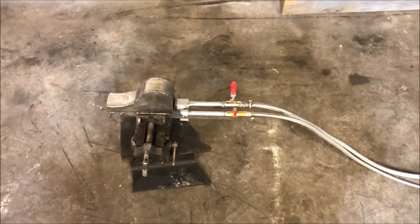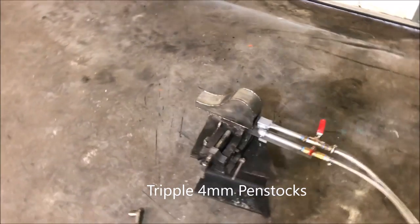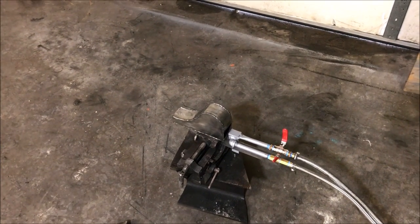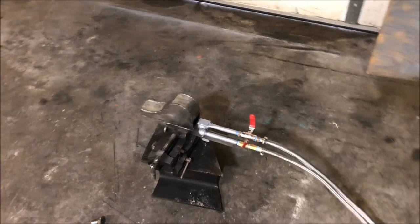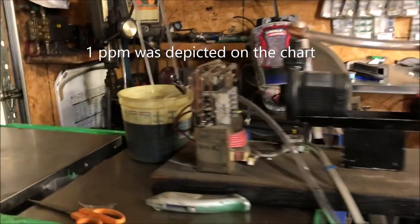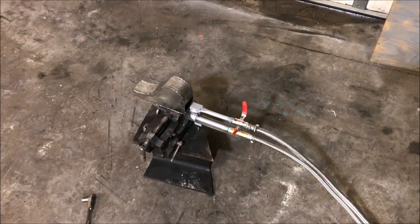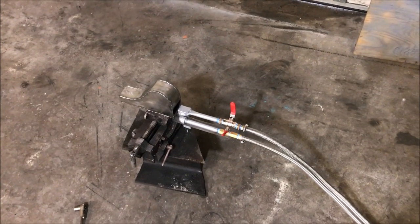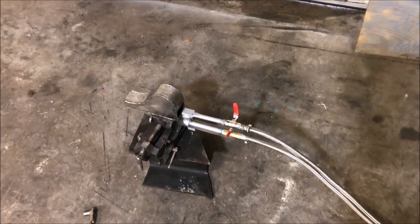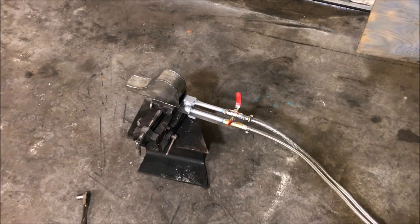This is a very powerful burner, and this should work out perfect. But I just want to mention one thing, guys. If you're burning waste oil, oftentimes waste oil contains a lot of heavy metals like lead and things like that. I know some oils have lead in them for a fact because I did an oil analysis recently. So be careful if you're using waste oil that none of the fumes is allowed to touch any food product of any kind. And you may even need to consider where your flue gases are going. You might want to check into that. If you're going to be running this around people for long durations of time, you might want to check your oil to be sure that you're not spewing out toxic amounts of lead.